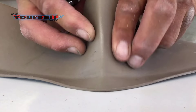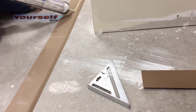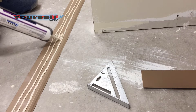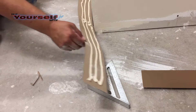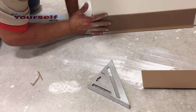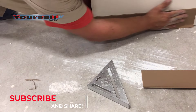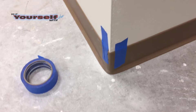Another thing the heat will do is keep the joint from turning white as you fold it. You can see during the demonstration how the base turns white without heat. After the heat I apply three strips of glue on the back of the base, then a little bit extra at the cut I just made. I would stop the glue right around the corner and then use hot melt glue to help it hold to the corner better. When you're applying pressure, push away from the corner — this will stretch the base and help it stick better. This will help prevent the base from lifting up at the bend. If it does start pulling away from the wall, blue painter's tape will help hold it in place until the glue dries.